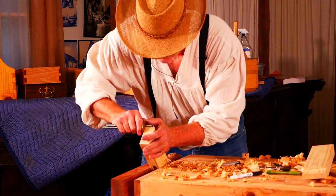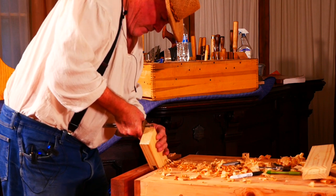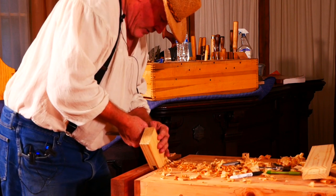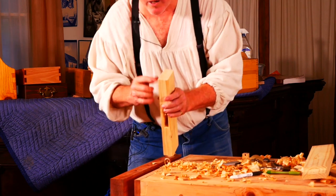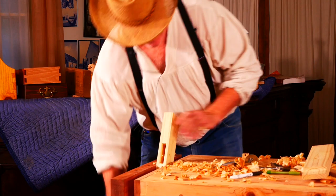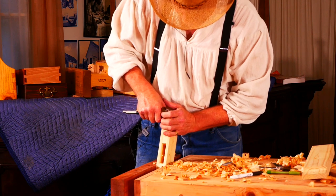We're going to do a super old-school cheek removal — splitting rather than sawing. I want these marking gauge lines really deep. I go to the other side and still reference from the same A side, marking deep lines down to about where the gauge line is.